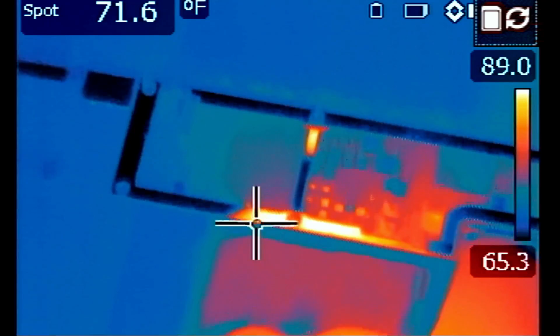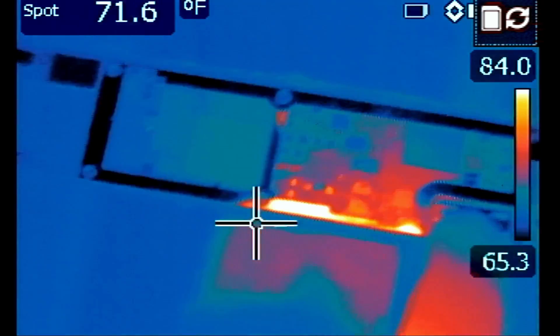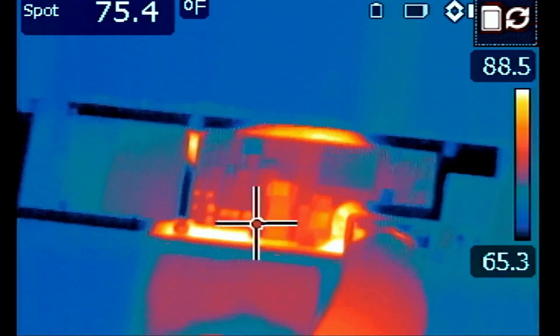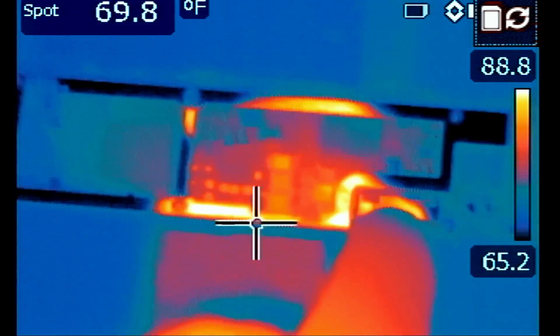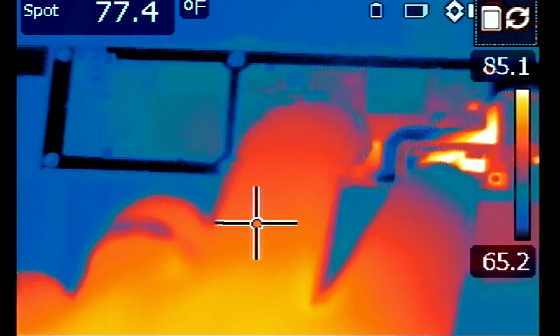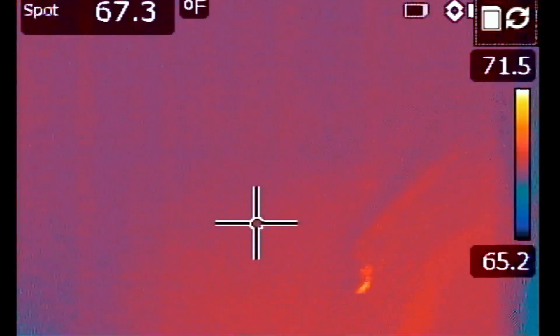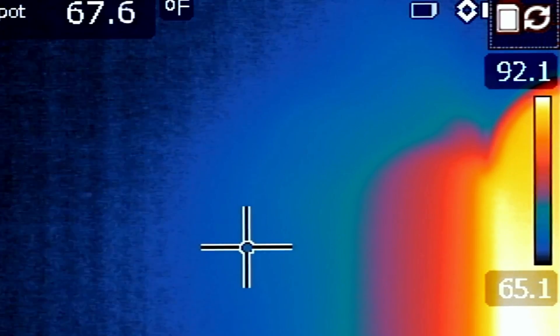The only thing I see hot on the board right there — that's most likely the 00090 IC, and I've worked on those before. That's the only hot thing I see on the board. The thermal camera showed us a heat spot there, but that does not mean that the chip is bad — it's something to take into consideration, especially since we have worked on a similar problem before.